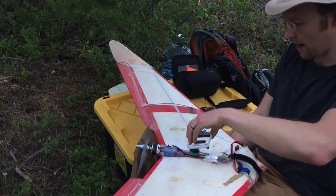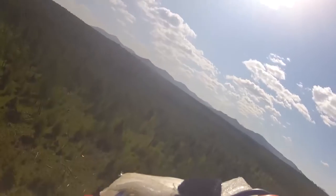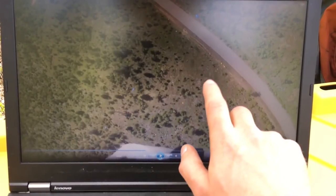So what I've done on our raw property was establish the corner points, and then I walked with a compass as straight as I could between those points and established as close as I could get to a straight line. And I marked that line with pieces of wood lath, tapped into the ground and marked with a Sharpie marker. And then I actually flew an RC airplane above the property with a GoPro camera strapped to the top of it, flying upside down to capture whatever I could of a picture looking straight down on my property to see if the lines I had laid out were anywhere near square and straight. And they were actually pretty decent.